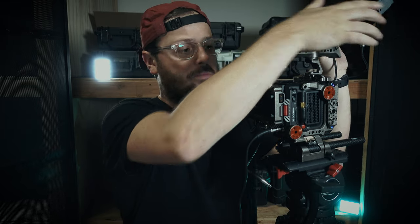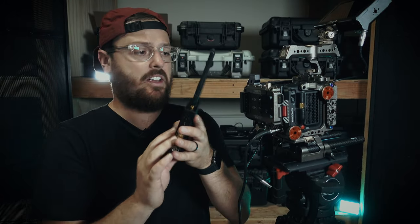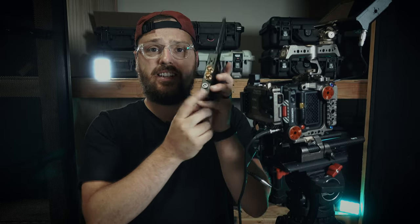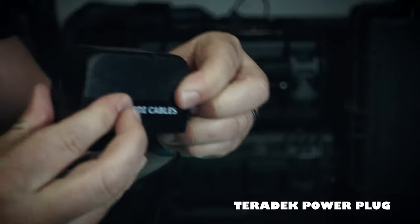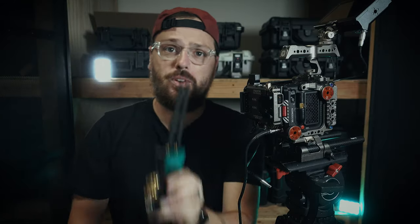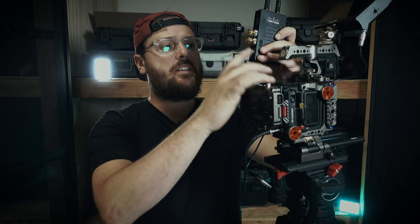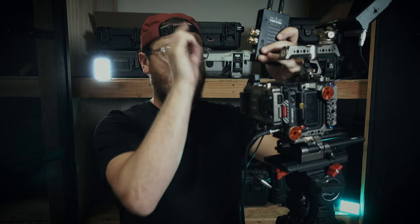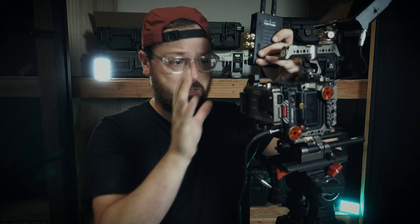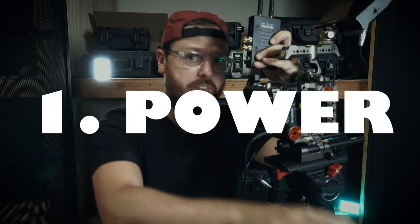The actual issue seems like it's not so much the camera power, but the accessory power. For instance, we have our Teradek here. If you're plugging the Teradek into AC power, you have to do it before the SDI — that's the big issue. So how I would do this: connect it to the rig, connect P-tap power to it, D-tap to here. Once everything has power and this is plugged into the wall, then you can connect SDI. Power first, then SDI.